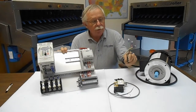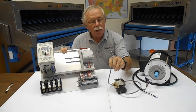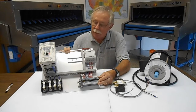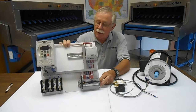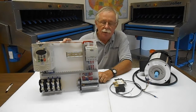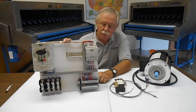The fuse block and the motor come pre-wired — it just connects to the fuse block. Everything is pre-wired. The solenoid, for instance, is pre-wired and gets connected to the terminal strip. This box's backplate size is a 14 by 16 backplate, and it should fit directly into the 14 by 16 boxes that production design products used.